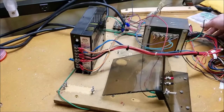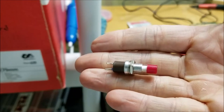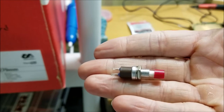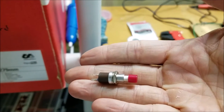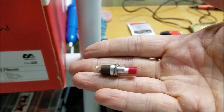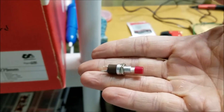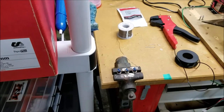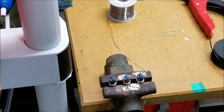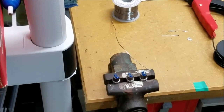I still need to get a speaker for sound and other things like a monitor and board, but we're pretty much there. Next thing we're going to do is wire in the buttons for player one start and coin up. I decided to also add the test switch — it'll be a momentary button for now, though I may need to change it to a toggle switch later. I've set up three switches and I'm going to daisy chain the ground from one to the next.